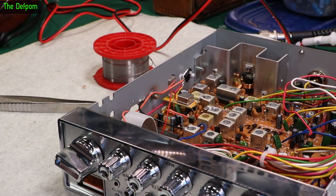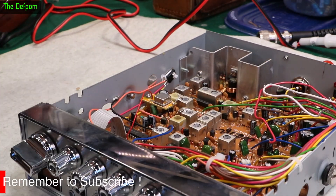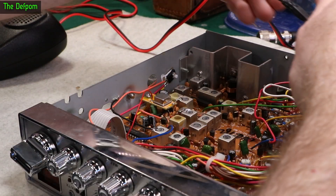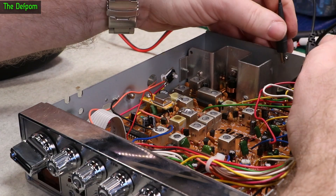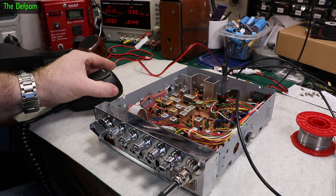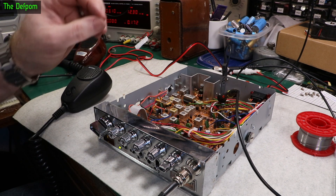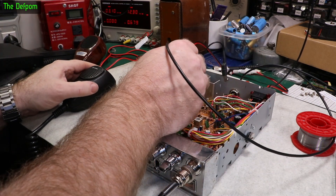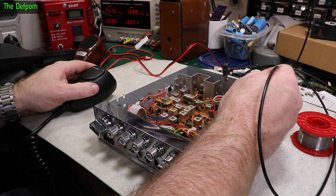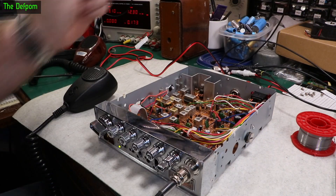Plug the mic in. It may or may not transmit on the right frequencies because of the VCO adjustment — I need to do that in the other room. Get the scope ready to go. We'll probe the RF section to see what we're getting from that. Power it up. Transmit. We are transmitting — we're getting too weak of frequency to see it. I'm going to have to go straight into the upper. Yep, frequency is right. That's working. Excellent.